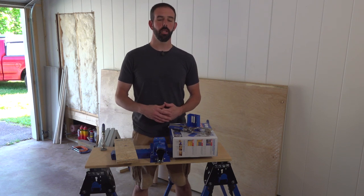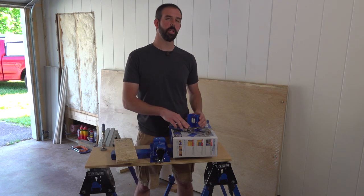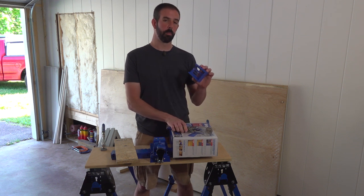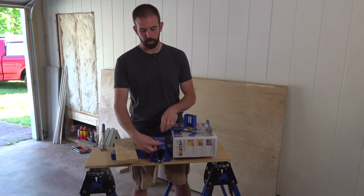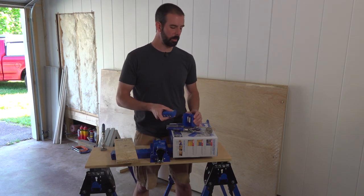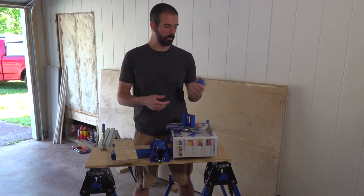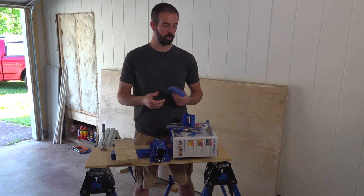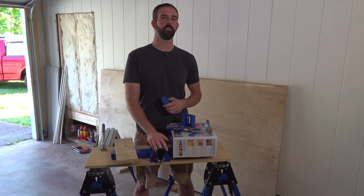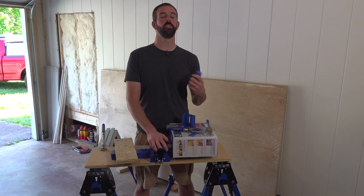Hope you guys enjoyed this quick video on setting up the K5 Master System. I think it's going to be a great system that's really going to help expedite our cabinet work. There are also other pieces that come in the K5 Master System kit — one of them being an AutoMax clamp, the other being a block that works with the AutoMax clamp. All you do is pull the block out for your drilling block, insert it into the portable block, and it makes it where you can work on large pieces that won't fit on this table, like if you're doing a 4x8 sheet of plywood. We'll show you these other parts in use as we get to them, but right now we just wanted to get it set up and ready to use for building our cabinet so we can finally get this kitchen done.